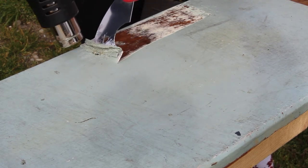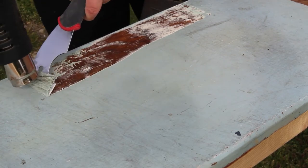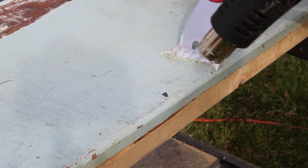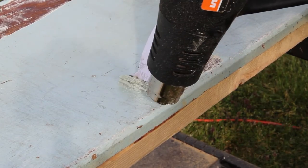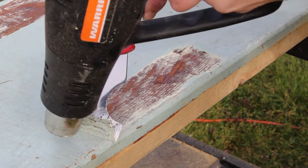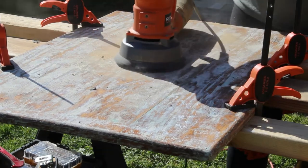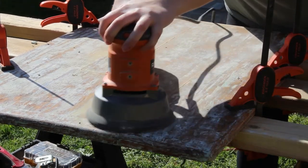With the heat gun, whatever you don't remove just dries back to normal paint once it cools, and you can immediately sand it off. With a chemical stripper, it usually stays gooey and you have to let it dry overnight before you can start sanding. Here's a close-up shot where you can really see the paint start to bubble up as I'm scraping it off. The heat gun method works best on flat surfaces — if you're doing a dresser top or sides, I'd highly recommend this. This is also a really inexpensive heat gun — I think it was $15 from Harbor Freight. I'm just taking my orbital sander and sanding off the rest of that residue to get down to the bare wood.